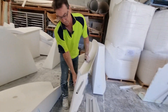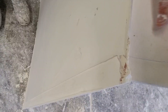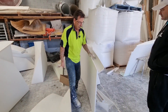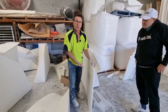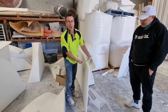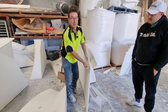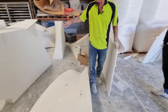The good thing with what we can do is we can put recesses on all four sides. If you look down here, it's got a recess on that side, a recess there, and a recess — we can recess any side you like, which makes it easier to install. The great thing with fibrous plaster is you can actually take it out, shape it, sand it. It's not like cardboard where you can't do much with it. You don't necessarily need to tape — as long as you back-block it and mud it up.